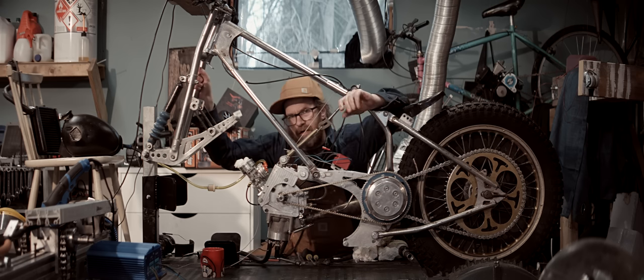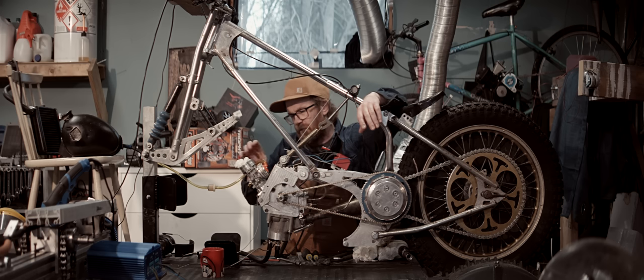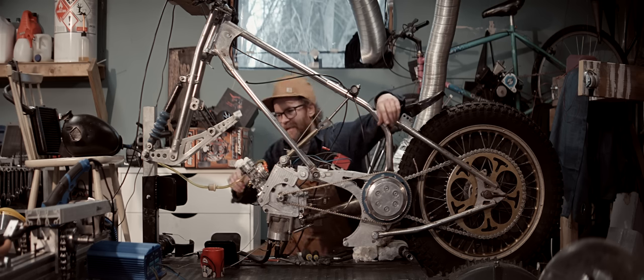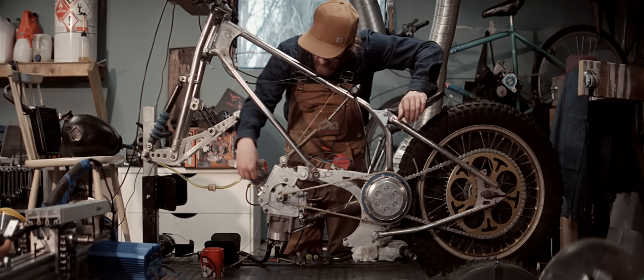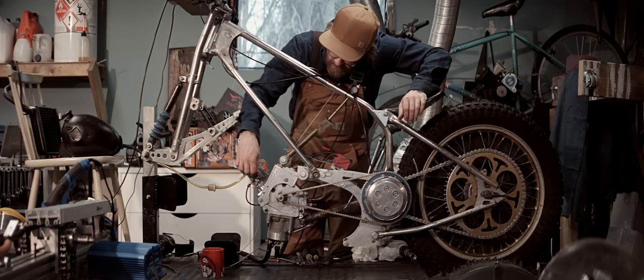I'm really curious to see how it behaves now with a pretty much normal crankcase volume. Still too large for reed valve, but should be better. We'll see. I'll reset the carb to 1.5 turns out on both needles as a starting point.